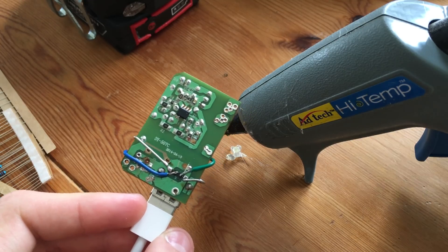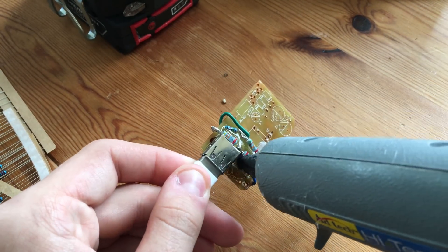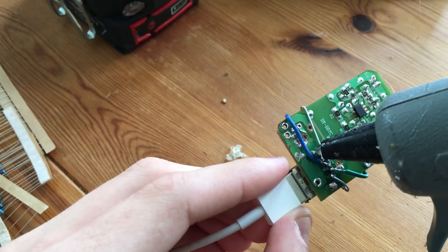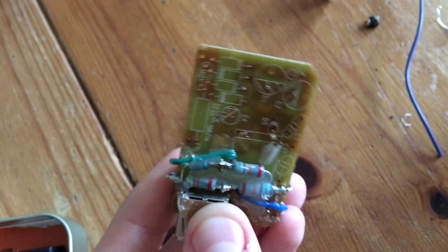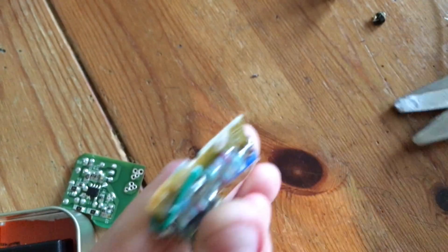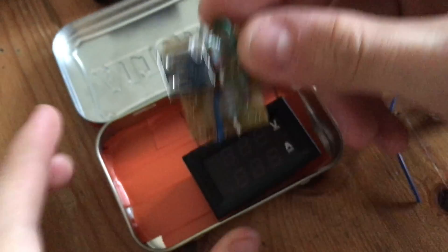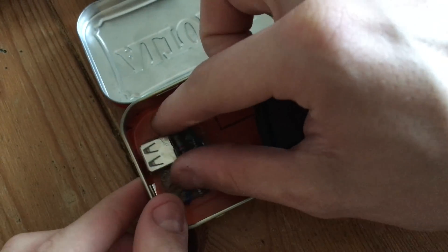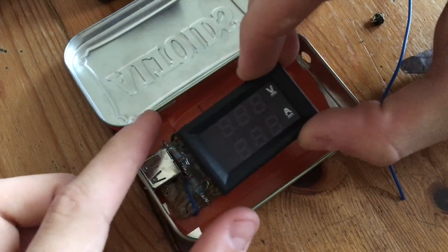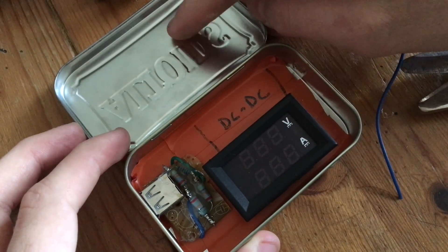It's time to cut the board down to size and add some hot glue, then turn it over and apply some hot glue on the bottom as well. In order to fit the board better inside the Altoids tin I'm going to cut off this extra piece that's not really in use with these snips — just chop the circuit board off like that. Now the circuit board is small and will fit over on the left inside the Altoids tin. I've marked out the DC to DC converter, and that basically leaves one spot for the volt and amp meter right here.